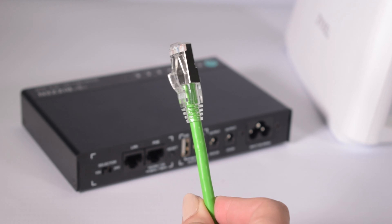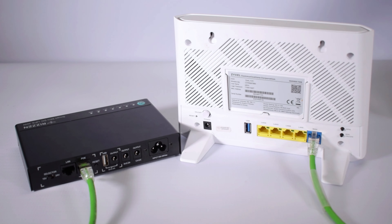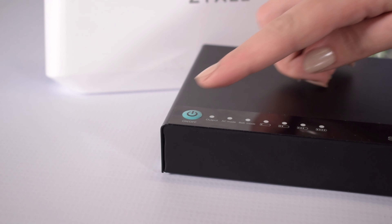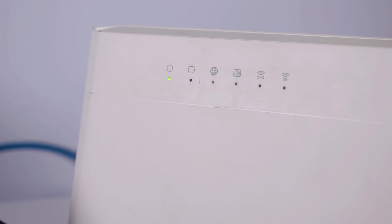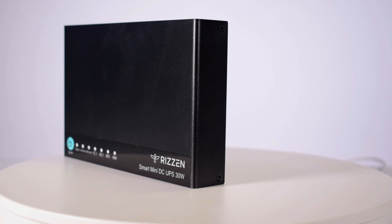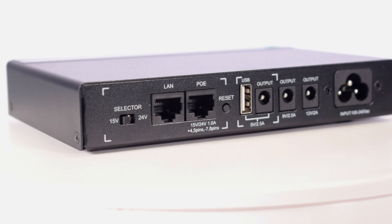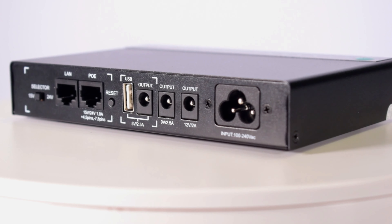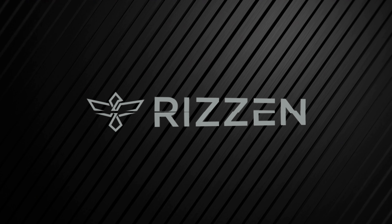You will first take the PoE cable and connect it to your device, and then connect the other end to the PoE port on the UPS. This is how it should look. We will then turn on the UPS to find that our router, access points, or outdoor CPE is now able to connect to the network while being powered through one cable. In conclusion, the Risen 30W Mini DC UPS is a fantastic device, enabling you to switch over during load shedding without any hassle, and you will be able to power up to 30W at the same time. Please remember to subscribe to our channel for more!